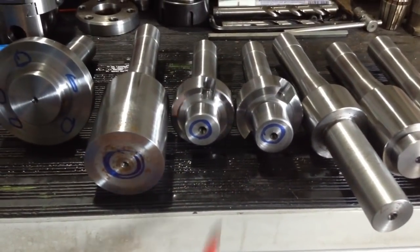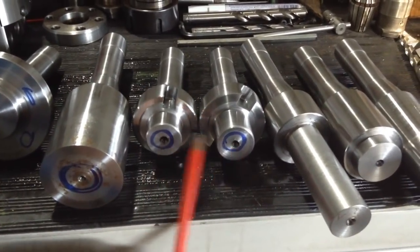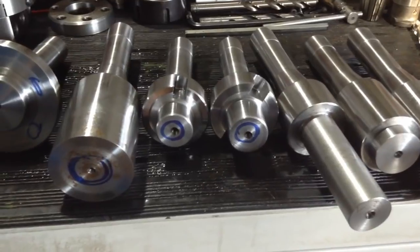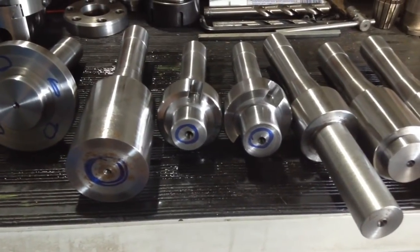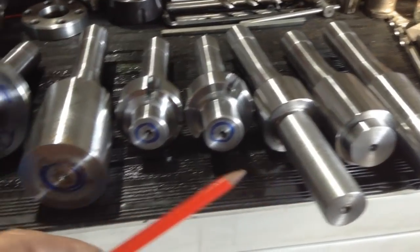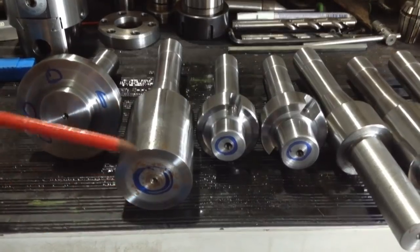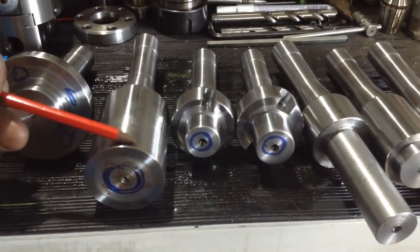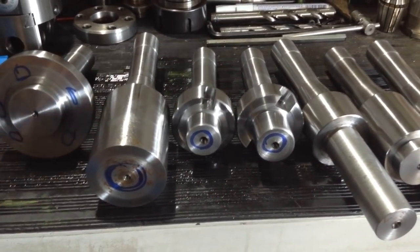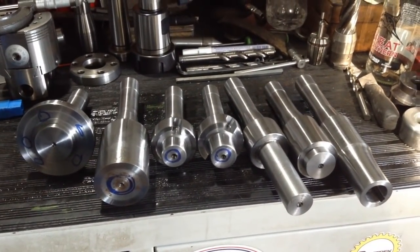I might get these two out of the way since it's a relatively simple job, and then that leaves in the next video we screw cut the thread on the end here. We have to bore out the features on the ER, and we also have to screw cut the 50mm thread on the OD of it. So I think we'll wrap this one up.